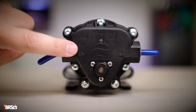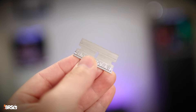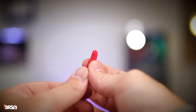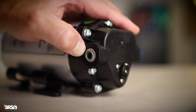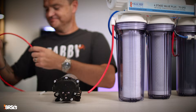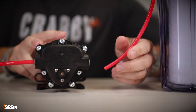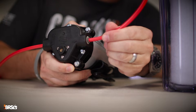If you look at the top of the booster pump, you will see two arrows which indicate the direction in which water needs to flow. Take an RO tube cutter or razor blade and cut the red RO input water line in between the water source and the filter. It's best not to use scissors here because even a slightly rough cut can lead to future leaks, especially with the increase in pressure. Now remove the two rubber pieces from the booster inlet and outlet by holding the push connect collar down against the pump and pulling the rubber pieces out. Take the red RO tube from the water source and push it into the input side of the pump, then pull it out a couple times to make sure it's securely attached. Now take the RO tube from the RODI filter and push it firmly into the booster pump's output, and give it a couple tugs to be sure it's securely attached.